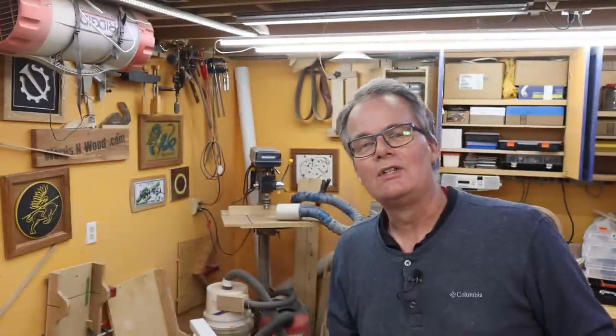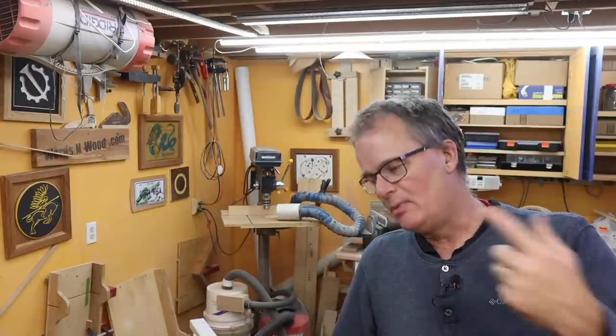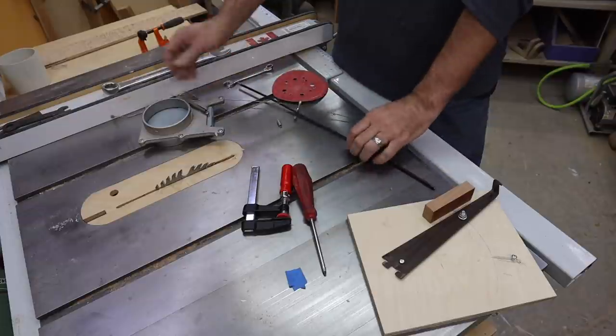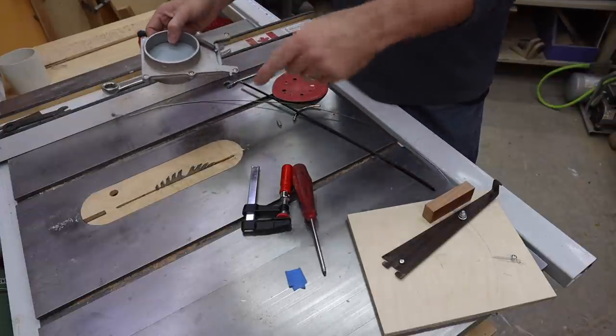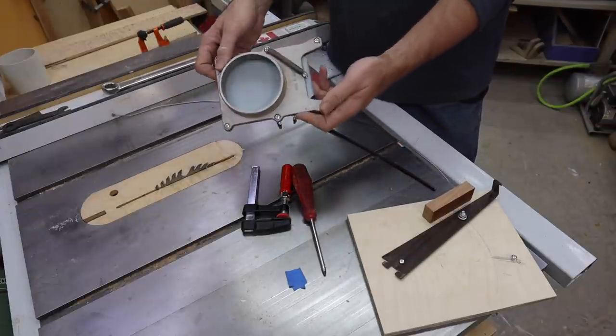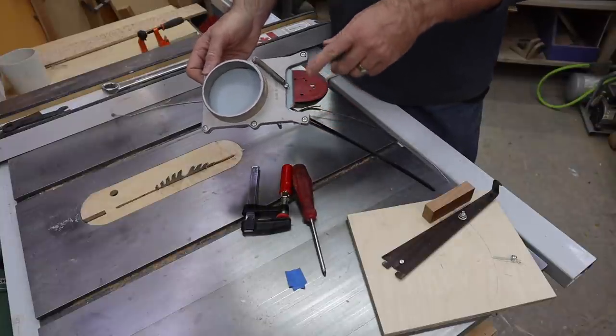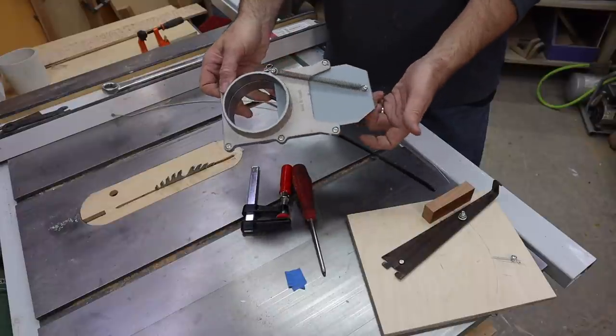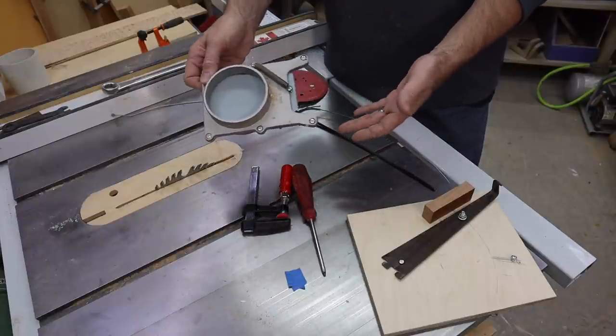So it's now several hours later, and I've been working on the blast gate hookup for the table saw. Let me bring you in. I've got a good prototype, I think. So there's three parts. There's my lever, there's the cable, and there's the blast gate. Now the blast gate's actually mounted under the table saw. I just grabbed this one from another spot in the shop. But the main point is that I have a spring on my blast gates. It snaps them closed.